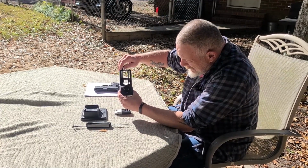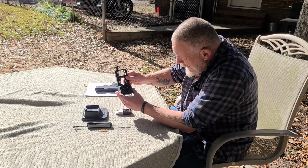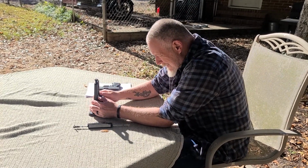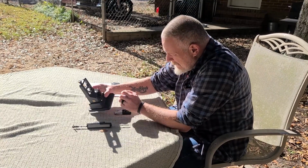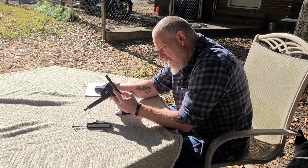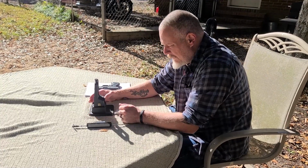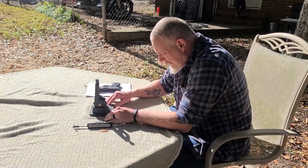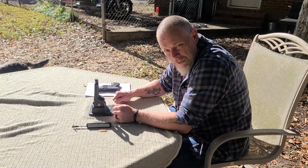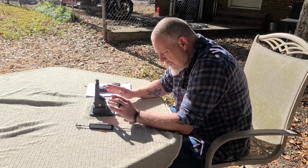It's adjustable to set the angle you want on the blade you're sharpening, and this snaps right into this base right here. Now, this unit doesn't tie to the table or your workbench, but it does have some non-skid plates on the bottom that allows you to gain a little bit of purchase on your working surface. But you shouldn't be manhandling something like this. You shouldn't be laying into it like you would with a file. This is one of those tools where you let the tool do the work for you.